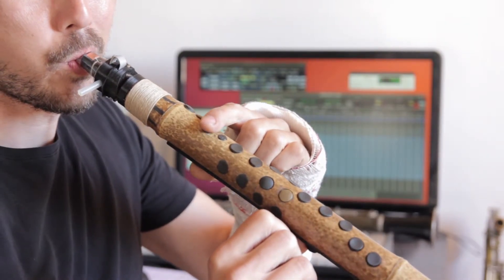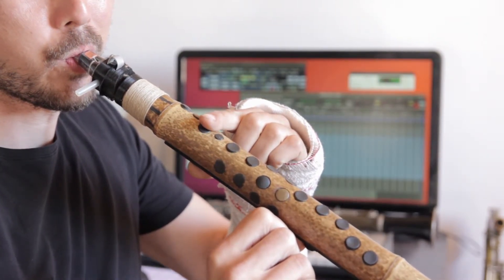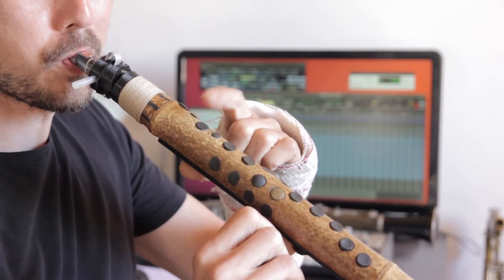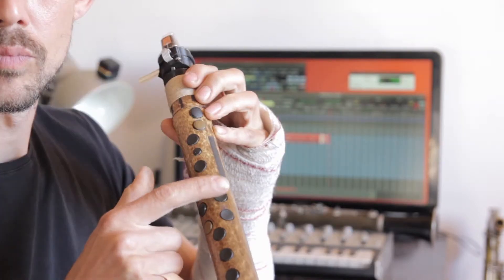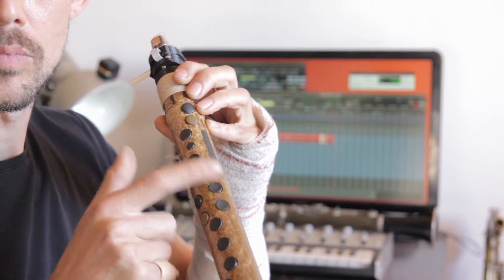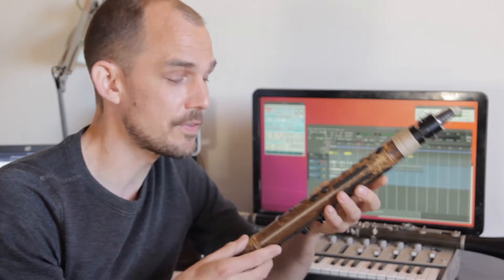For example, in the default horn playing mode the keys are mapped to a binary output, so they can be read at a lower resolution to attain super fast read times. But those same keys in the percussive playing mode are read at higher resolution, allowing velocity control. Perhaps in the future I will implement pitch bend in the keys to take advantage of their capacitive nature, but that comes with a whole selection of other conceptual problems. Suffice to say that it would actually be a completely different instrument from the Open Horn, which is basically hardcoded to do pitch bend in the neck of the instrument.